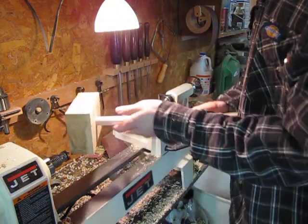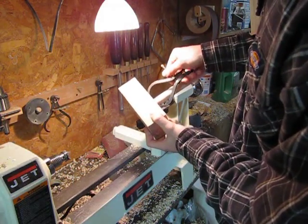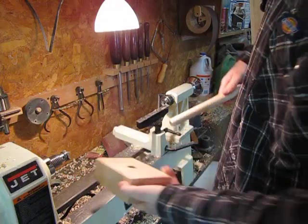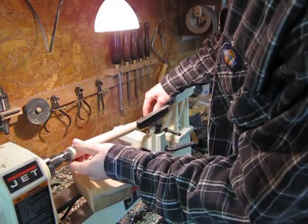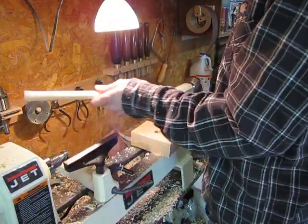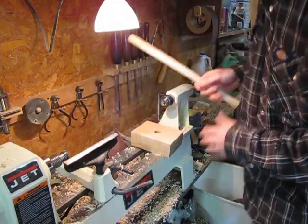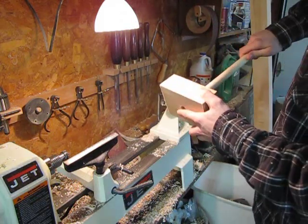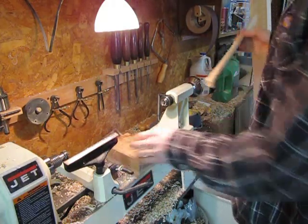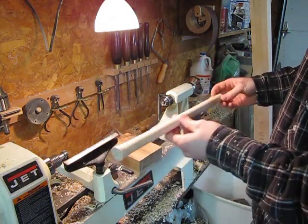You can see there it just started going in, so I make sure my calipers are set, and then I can turn the rest of the dowel down to that size. Here I have the dowel — the whole thing has been turned down to the size of the calipers. You can see it's still kind of tight, and that's perfect because then you can chuck it back up on the lathe and use some sandpaper to even out and smooth the entire surface.